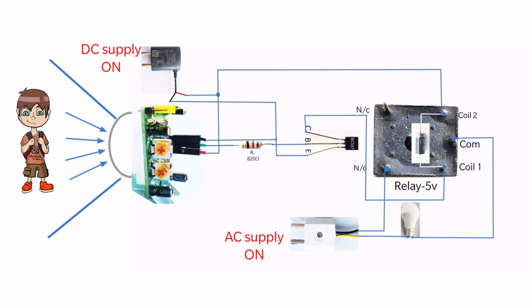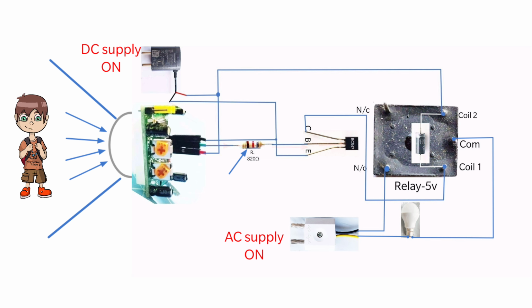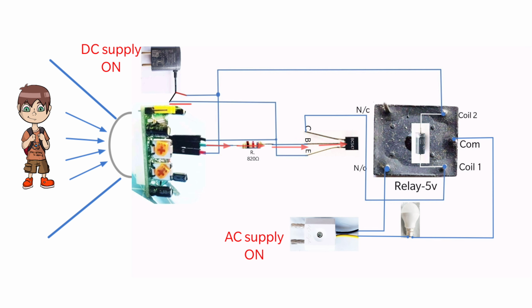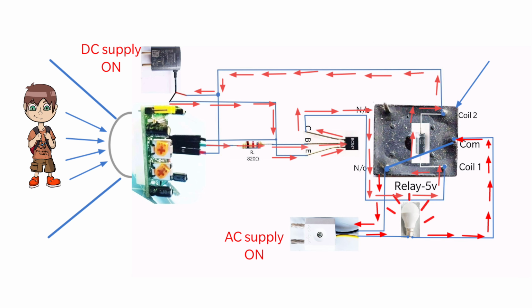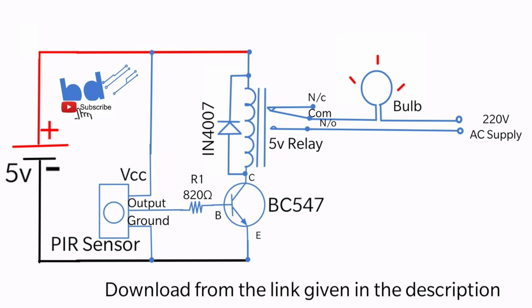In this circuit, when the sensor detects the IR radiation, it sends electrical signals to the transistor via an 820 ohm resistor. Here this resistor is used to limit the current. When the transistor gets the base current, it conducts electricity between the collector and emitter, and the light bulb switches on using this 5 volt relay. Here is the circuit. You can download it from the link given in the description.